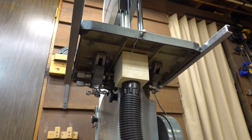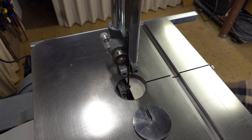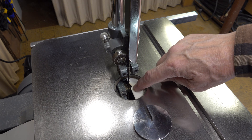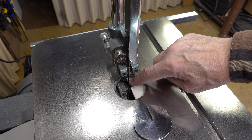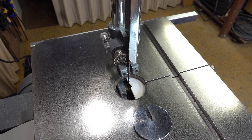The next thing we'll look at is what it looks like from the top to give you an idea how it's surrounding the blade. Now here you can plainly see this is where it hangs at this point right here. So our main vacuum is starting exactly where the side of the blade is. Immediately, the second it starts cutting something, the vacuum is working on it. So it gives it time to pull that out of the airstream before it gets down too far into the saw and makes a mess. It really does work — I've had this for about 30 years on here and it works really well. So once again, why not share it?